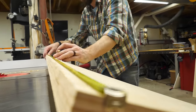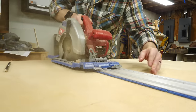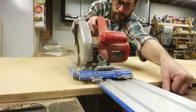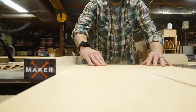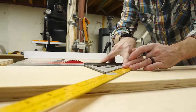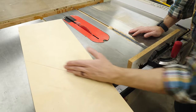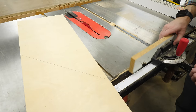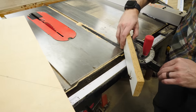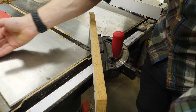We're going to start by building a cabinet. I need to cut one piece down into two with a 45-degree angle on each piece. I've got the center point marked at 45 degrees, and on the miter sled I'm going to set it to 45 degrees as well. I'll push it up against the sled, line up my mark with the blade, and cut it.